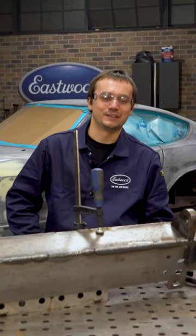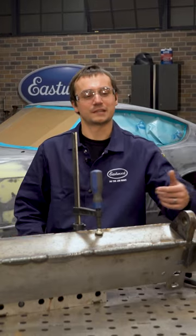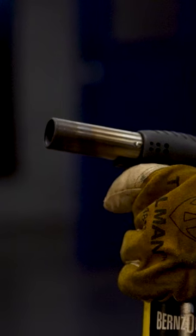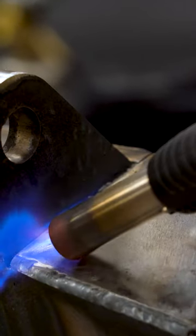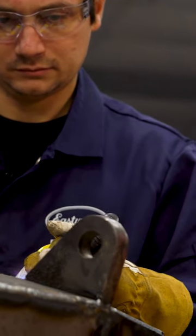So with the MiG-90, we just don't have the heat we need to be able to weld this 5/8 steel plate. What we are going to be able to do is take a map gas torch and preheat this 5/8 plate, put as much heat as we can in with the MiG-90, go really slow, get as much penetration as possible, and build up multiple welds. That's going to give us the strength we need and still be able to use our 120-volt welder.